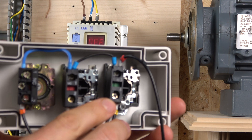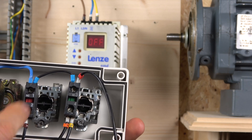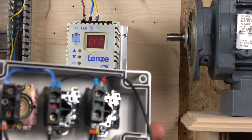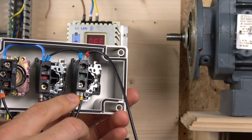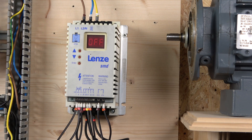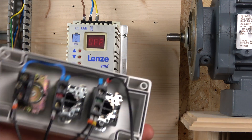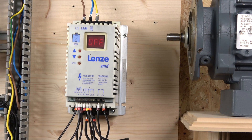We have a two-core cable coming from output terminal 20 — our power source — providing power to all the switches. After the stop signal, the wire goes to relay contact K14. Cable number 3 comes back from K14 to the start signal, and that's where you create your latched system. By default, K14/K12 is closed, so you need an open contact configuration there. The e-stop still goes back to E1, which has been pre-programmed to accept a quick stop command.